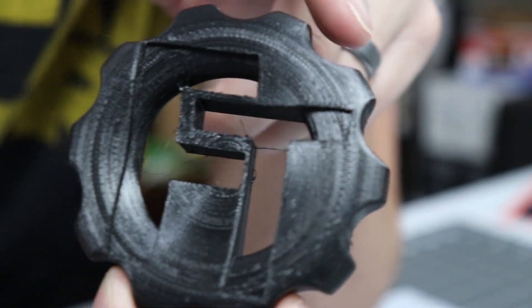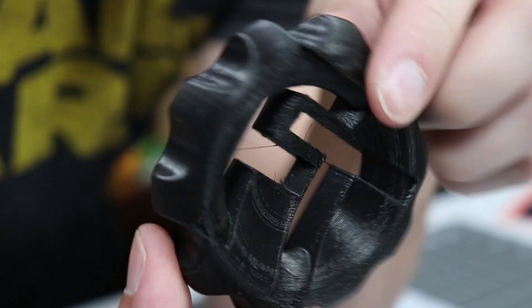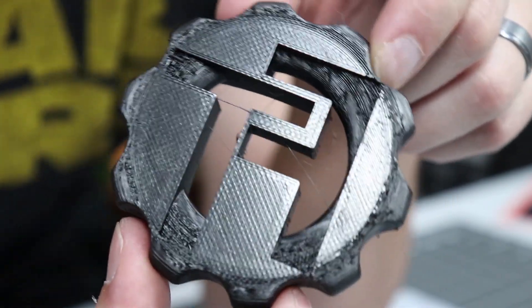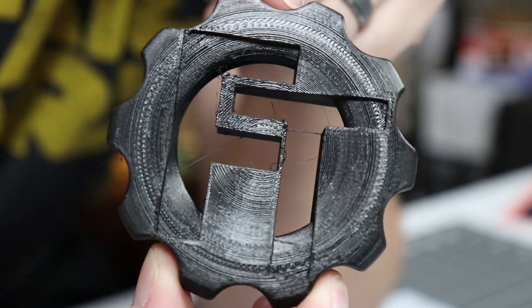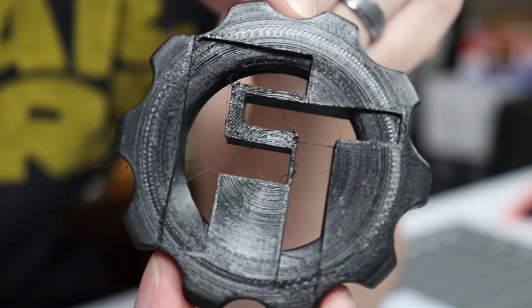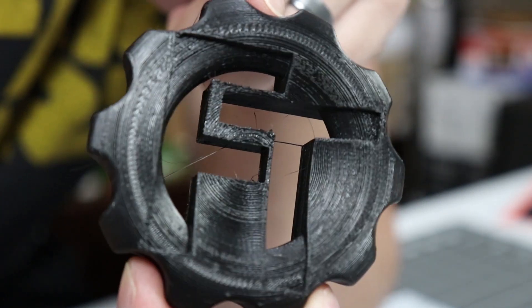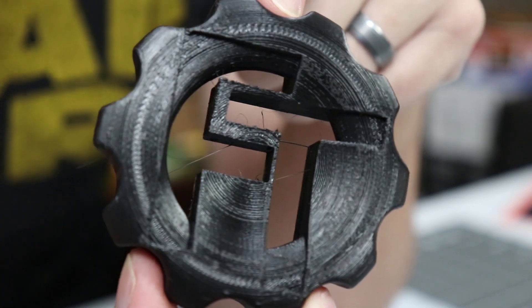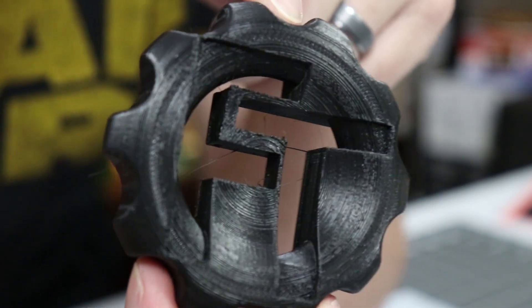Here's the filament from PolyMaker — this is their PolyMax PETG, which I've never tried before, and it is amazingly shiny. This stuff printed like butter. Printed on my Anycubic i3 Mega — you can see the shine and a little bit of texture from the Ultra Base. Printed straight on that, no glue stick needed. It did an excellent job with the supports. My settings were 235°C, bed at 70°C, speed at 50 millimeters a second, with fan at a max of 30%. Note: PETG can weld itself to PEI surfaces, so use a glue stick as an interface if you're on PEI, but on the Ultra Base you really don't need it.